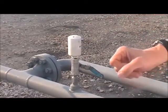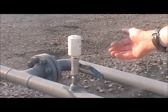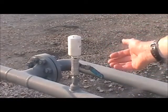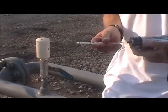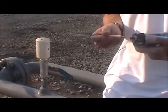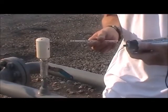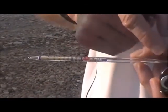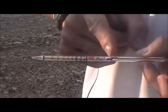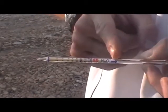Don't allow the gas to flow too strongly, or the expansion will cause a rapid cooling of the gas and the bulb. When you're ready to make the measurement, it's critical to avoid intrusion of humidity from the ambient air. Don't open the tube until just before you're ready to make the measurement. First break open the end of the tube that goes into the pump, because it doesn't matter terribly much if there's a slight intrusion of humidity onto this side of the tube.